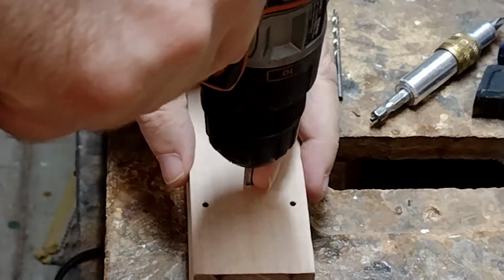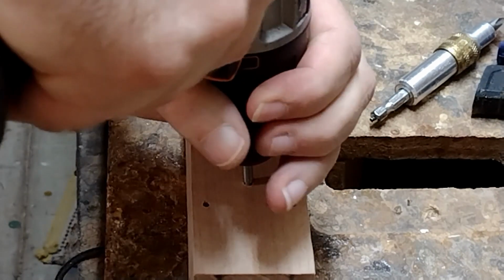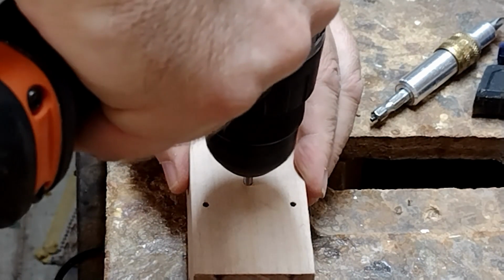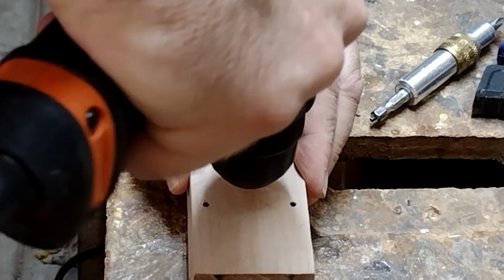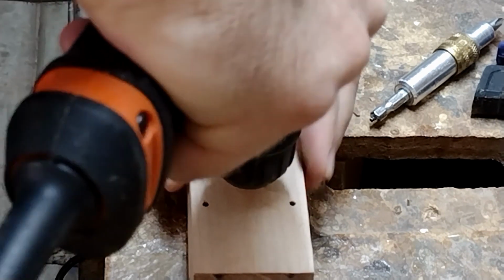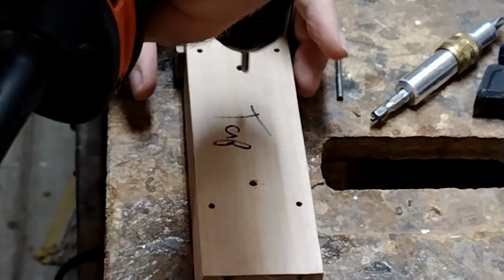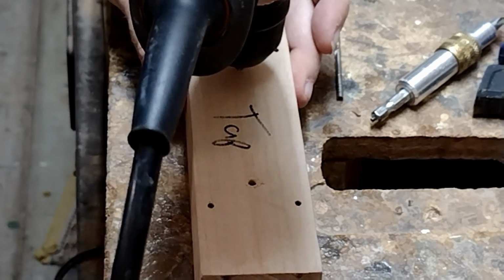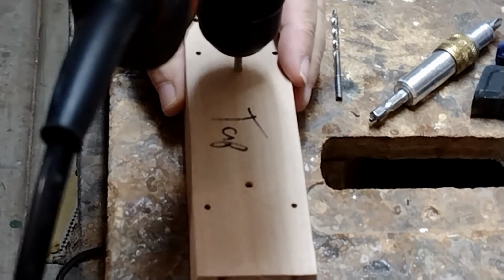If you're paying close attention, you noticed I put the word tap on the bottom of that jig, and of course, I'm going to tap from that side. I've lined up the screw holes from that brass rod, and I'll tap through that hole. I didn't have that word tap there, and on the top, I also have added the word drill. It's easy to get mixed up, and once you run the tap through a drill hole, it kind of ruins that jig. So you might guess what happened there and why I had to redo the top piece, but we'll go from there.